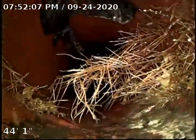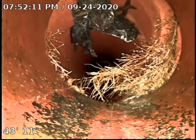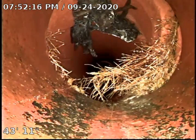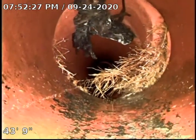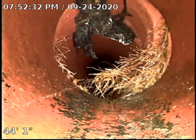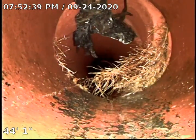It is recommended to hydrojet this sewer main right here. These are the tree roots we're talking about. The pipe has been offset here as well, and the tree roots have penetrated through the line. It is highly recommended to hydrojet this area — it's at a stage where it could easily start catching solid waste and eventually clog up the main line. Hydrojetting is just a service, not a repair. Repair requires excavating the ground to get to the root of the issue, then cutting the pipe and replacing it.